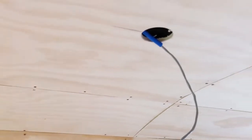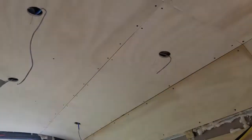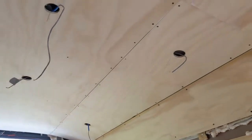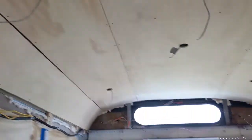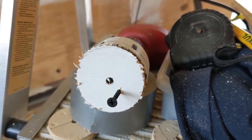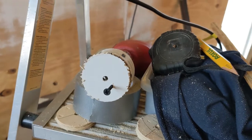Two more holes done — the wires are popping right out like I anticipated. I've got one more here and one more over there to do. Just like that, the bedroom section is done. It was pretty quick and easy once I built a little template with markings on a piece of wood to find centers faster. Here's a little trick to get the plug out of the hole saw: just drill a screw tip into it and pull it out — much easier than fighting it through the slits on the side.